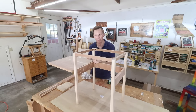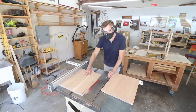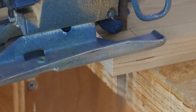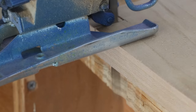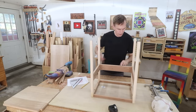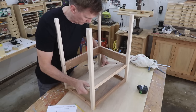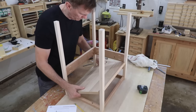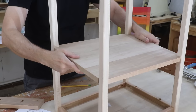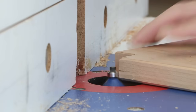Now I can cut down this lower panel to fit inside with notches for those corners. Here I'm just using my jigsaw to cut out these corner notches — it'll fit around the legs. To test out the lower shelf I need to remove one or two of these braces. I just needed to make one notch a little bit bigger on one side. And of course I'm going to put a chamfer around all these edges.